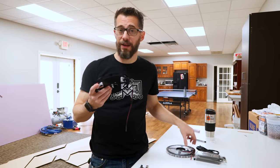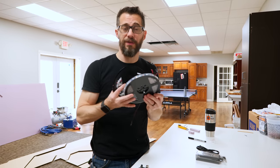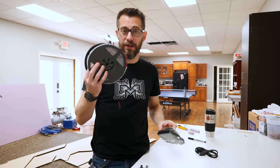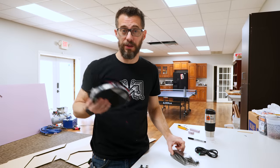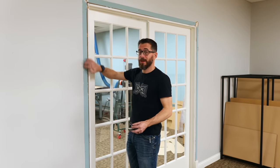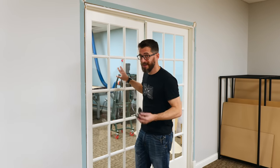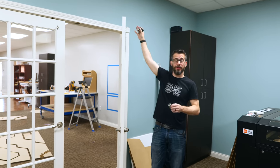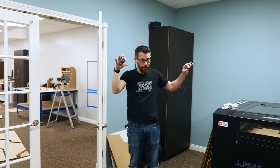And another thing to point out is that with a whole lot of LEDs, you have to have a separate power source. So we've got a power brick here that will just be feeding power to the LEDs to make sure that they're bright enough for us to see in the room. So those LEDs are gonna be mounted right here, but all of the electronics need to be mounted inside this room. We're gonna mount this sensor and the Arduino in a little box up here to make sure that it's getting airflow just from this room for testing.